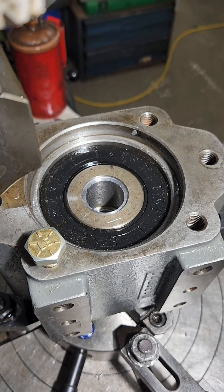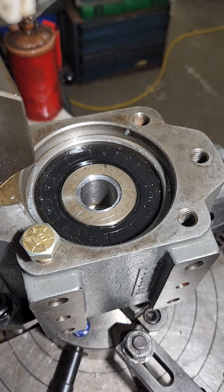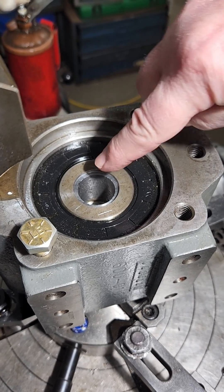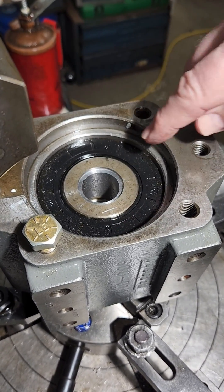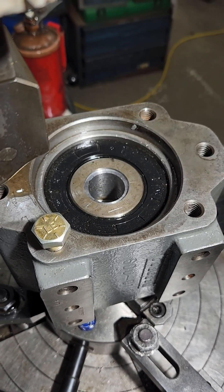Again, we didn't want to tear it all apart, but that's the other option — to take it apart and anneal the piece so that it's soft. Since it did cut some here, I'm thinking that we'll be okay since we're through the case hardening, we believe, by counter-boring that.